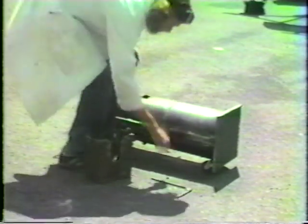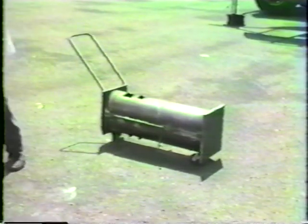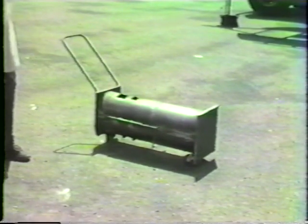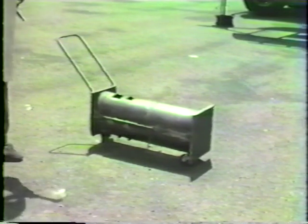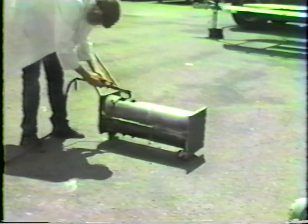This unit about to be disabled is the Aeroquip Maxi II model, mounted in the disablement chamber so that the clamp band bolts are up and down. To disable the Aeroquip Maxi II chamber takes slightly longer, as it is first necessary to melt the aluminum safety tabs and then cut the clamp band bolt on each side. In spite of this additional operation, disablement can be done within two minutes.